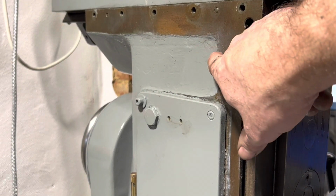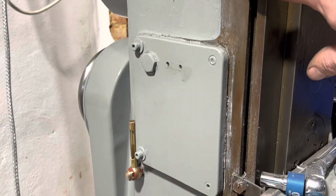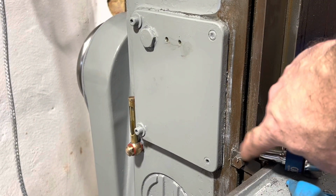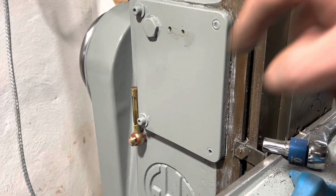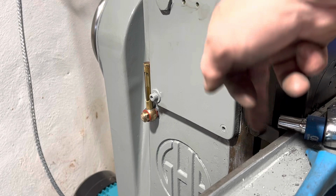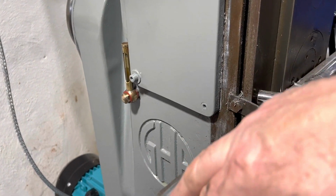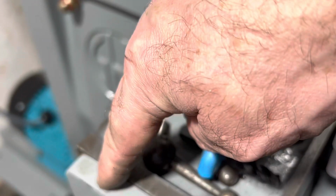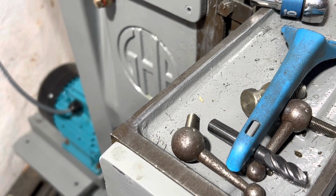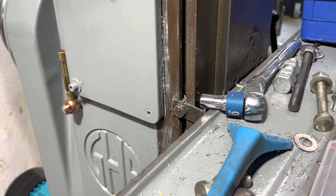See up here, castings are not quite finished there, but these are the surfaces that matter. These are the slide-in. You can slide a T-nut up and down with a stop, and then that is actually triggered. This triggers a lever further down that stops a power feed, so it stops you dropping this too far down there and running it into a hard stop. So you can adjust the stop, so you can cut your feed out at certain depths.